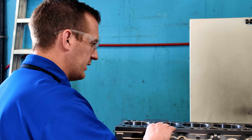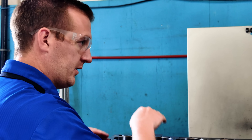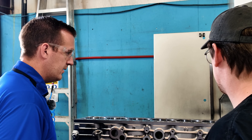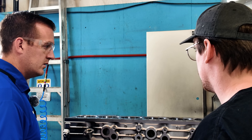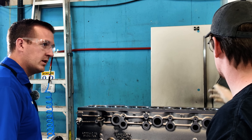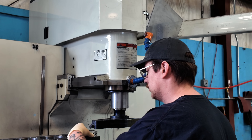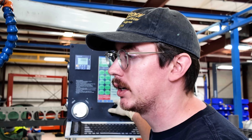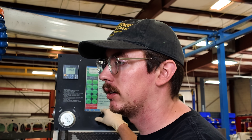Talking with Mark Malberg — if it's a little bow-shaped, a head gasket and stuff can kind of conform to that, but if it's choppy and really rigid, the head gasket can't seal to that. So how do we prevent those ridges in the deck? We'll take our finish pass and go at a different feed and speed to go really, really smooth — to try to prevent any cut marks and be as close to perfectly smooth as possible. Part of it is also having a good machine that's really sturdy and stable. We'll take one quick pass at 3 thou and see how much it'll clean up, and then from there see how much more we need to deck to get it perfectly flat and fully resurfaced.